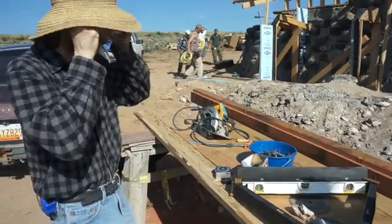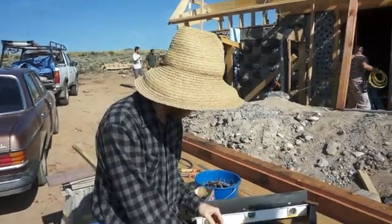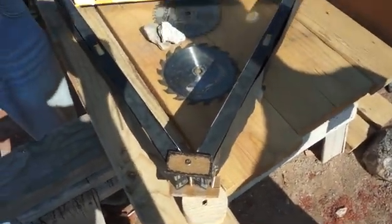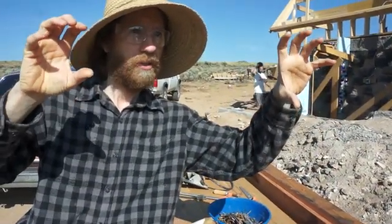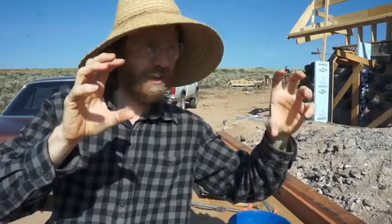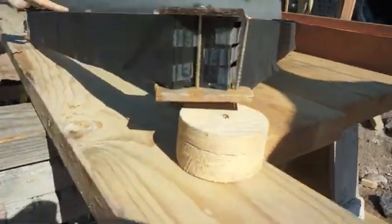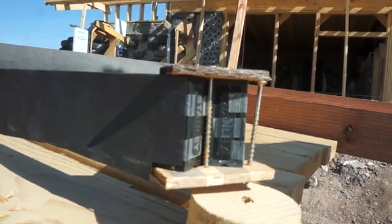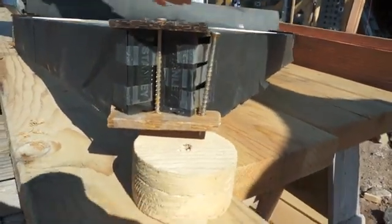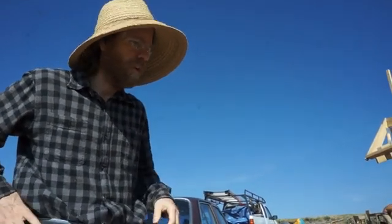Basically, you have three identical levels here from the hardware store — you can get these pretty cheap. I took the top of one and touched it to the top of another level to make sure they agreed with each other, and I'd very carefully cherry-pick three levels that all agreed with each other for extra accuracy. Then I clamped them together so they're flush at the same elevation at each of the three points, forming an equilateral triangle.